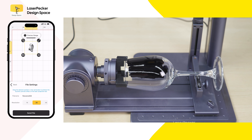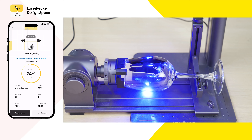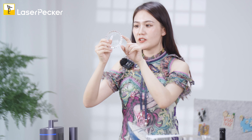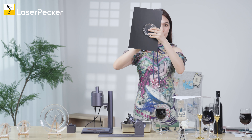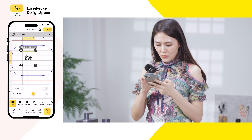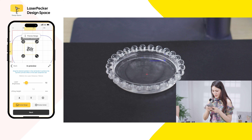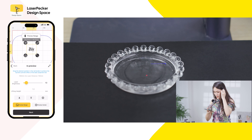Send the files. When choosing the diameter, I'll use 70, as that is sufficient for this glass. After you clean off the marker, the surface will look clean. When the laser passes through the transparent glass it leaves no mark on the glass itself, but if you place dark paper underneath, the dark paper absorbs the laser and leaves the mark on the glass. Input the key, choose B&W, preview, adjust the engraving area size, and adjust the height so the two red dots align. Then start engraving.